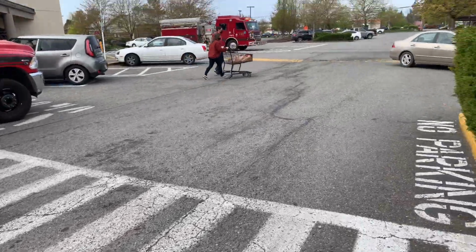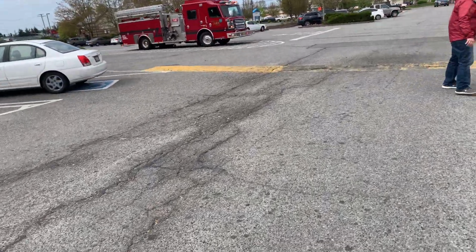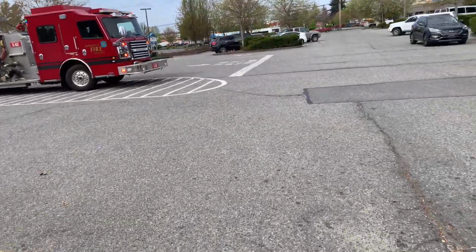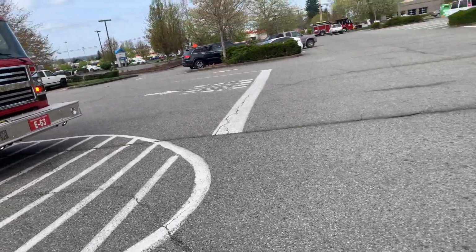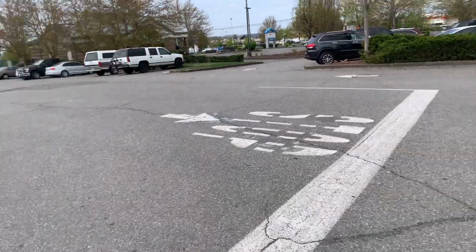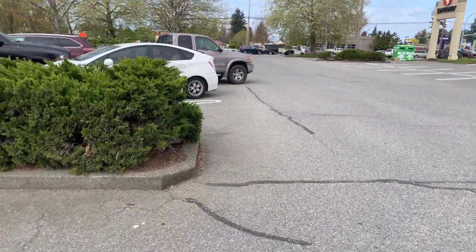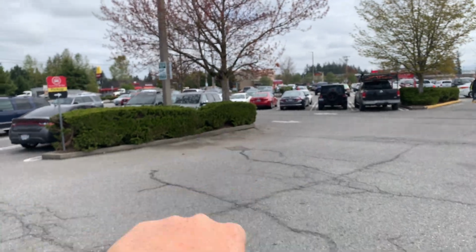This though would be part of the repair. You can see it's damaged all the way out here. We got another 24-foot speed bump that would be taken out and replaced. This ADA area would be part of the removal process. And we would bring it out past this curb, and then continue it all the way through from that curb straight through, catch that area, and then go to this curb here, remove it all the way to there, and down here get some of these tree roots removed.